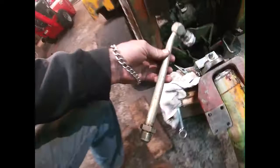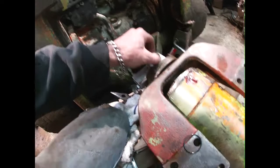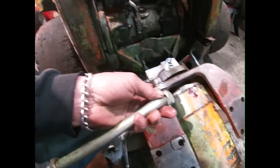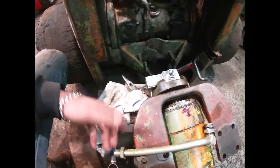The actual main line where the oil goes in - there are two fittings. There's this little aluminum one with the screen in it that sits in the actual block housing, with a little O-ring at the base which was a little loose with a bit of play. And then this one right here is an O-ring boss fitting. When you put it in, this is the lock nut that locks it down - this was loose, the O-ring was squished flat, it was ruined. Here's a picture of what's left of it - it's not even round anymore, it's squished and destroyed. The hydraulic shop should have rebuilt this section when they were pulling it all apart, but apparently they didn't.